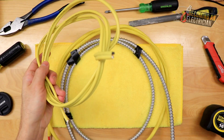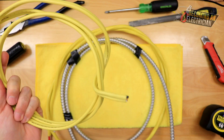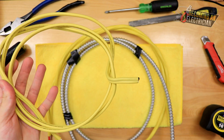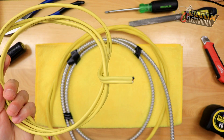This is 12-2. We're typically using this for kitchen counter plugs — something that's a little bit more dedicated. We use a 12 gauge wire which is rated for up to 20 amps, but always look at your code rules because depending on whether it's general use or for motors, different rules apply.